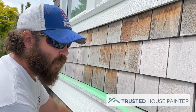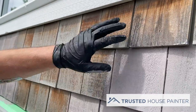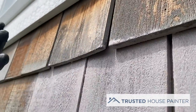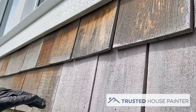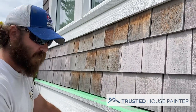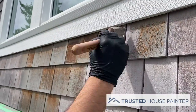This is sort of the perfect time — we can come in, do a hose scrub, and then leave the wood fibers intact. If you leave it any longer, you can notice this one's sort of starting to bow. When they get really dried out they curve, and then when you try to pin them down they snap. Just one here that's starting to curve; everything else is in great shape — perfect time for us to come in and preserve this wood and protect it for the long run.